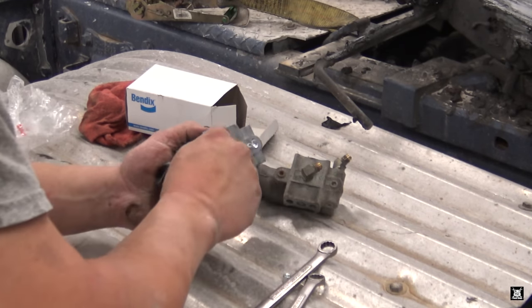Now that it's freezing cold, smoky in here. Just cuts off at about 120. Pump the brakes, backed it down to about 90. It recovered, came back up, popped off again at 120. That's good, that's done. She's fixed.